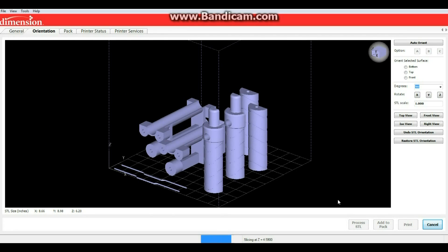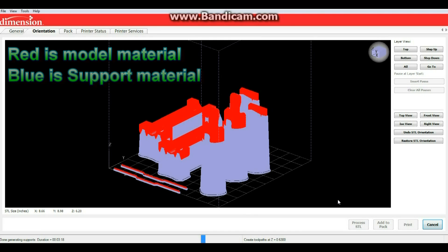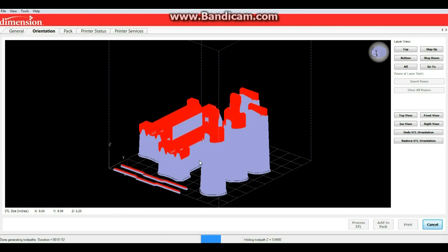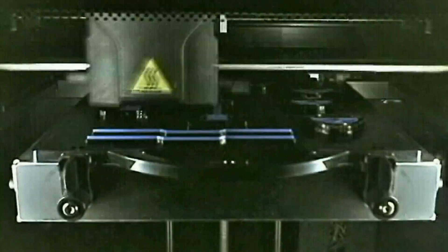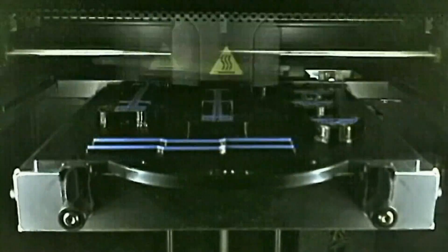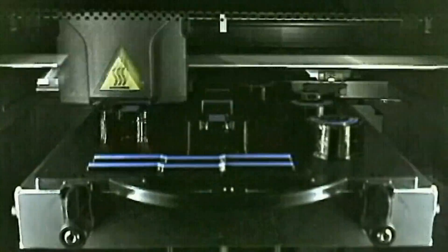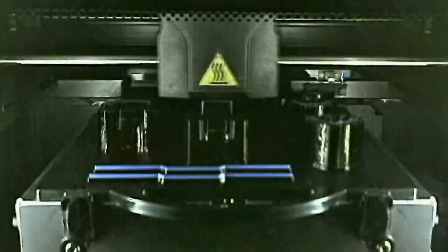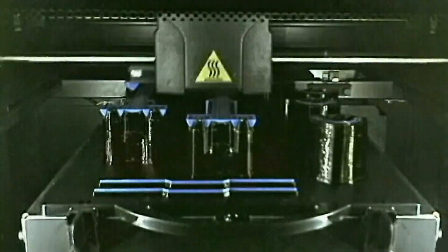Now that I had all the tooling done, I had to cut it up into sections because our 3D printer is only capable of printing a size of 10 by 10 by 12 inches. What you're seeing right now is the 3D printer's program that is actually taking the parts that I've drawn, cutting them up into layers that are about 0.01 inch thick, and it writes the toolpath for the printer from top to bottom, then sends it to the printer and prints.